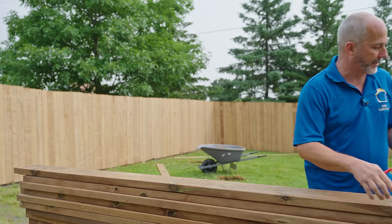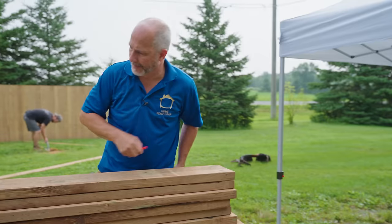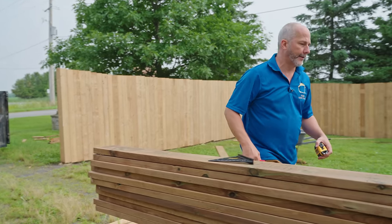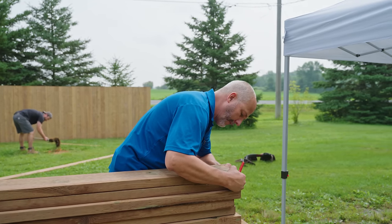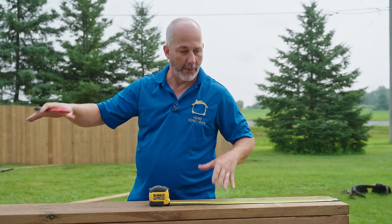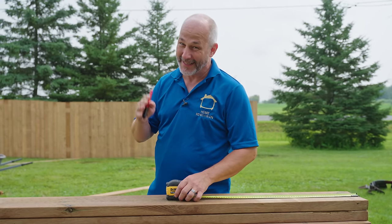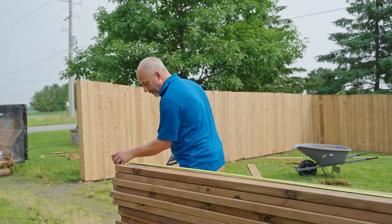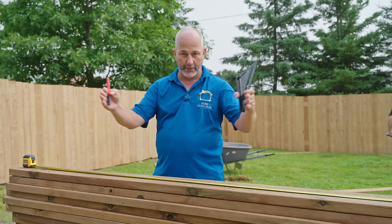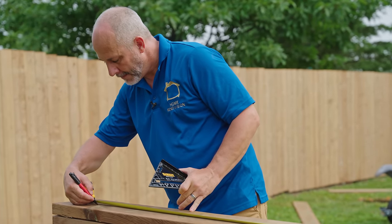Now in order to do the cuts we're going to follow a simple procedure. We're going to flush these together because I hate measuring over and over again. The reason we're flushing up at one end is you can't just say this is a 10-foot board and measure off six inches — you always have to measure from the beginning. Pressure treated lumber generally speaking comes in varied sizes; you're not going to get exactly what you think you're getting. This one is 10 feet and an eighth — not a big deal, but if every board has a little variance and you start sticking them together on a deck, your deck frame is all over the place.